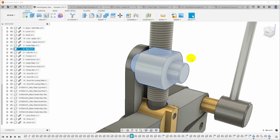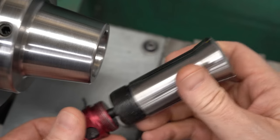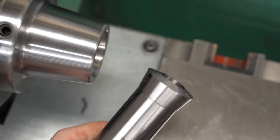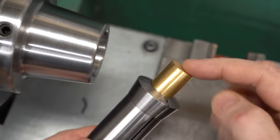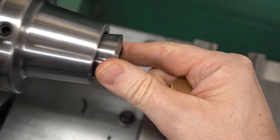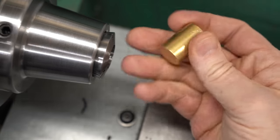The first part we're going to start with is the brass nut. This is the part that has the threads for the adjustment screw and a couple of pivots to fit into the side plates. To turn this on the lathe we're going to use a collet stop - this one happens to be from Edge Technology, but you can even make these in the shop. The stop just threads into the internal threads on the back of the 5C collet and provides a positive registration for the part placed in the collet. This allows you to swap parts or take the same part out and put it back in without losing the Z position you have programmed in your DRO.